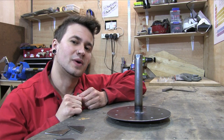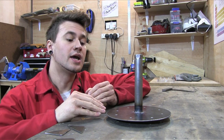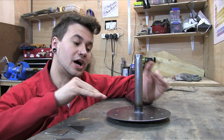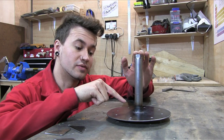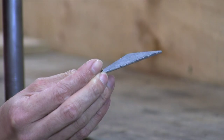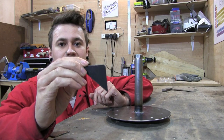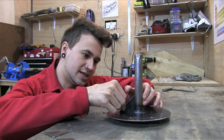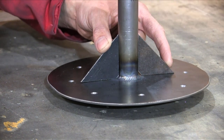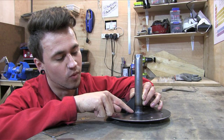Now that we've got the plate and post welded together, I need to talk about this joint. Although it's welded both sides and seems pretty strong, when you're sat on this seat, if there's any uneven pressure — so you're sat further on one side of the post than the other — that's going to put a lot of strain on this joint. So in order to prevent it from failing, I've made these. All these are is some sheet metal triangles with the top bit filed off so there's some clearance for the weld. I intend to weld these on at regular intervals — say quarters — and what that will do is help spread the stress throughout the whole bracket rather than all of it being concentrated on this one joint.